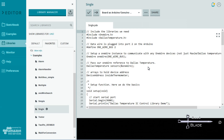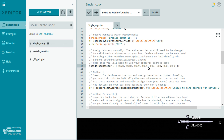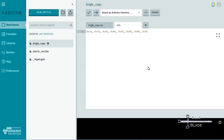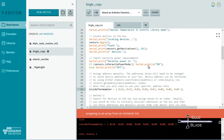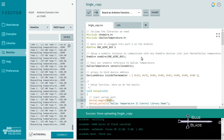Go back to Libraries and this time select a single sketch. Copy it into your project folder — we'll need to make some modifications to this. Paste the address we just found to the inside thermometer parameter. I also open up a new note tab and paste the address in there so I have easy access to it later. Copy the inside thermometer line and comment it out. Then above, we replace the undefined array declaration with this. Now change the value of the bus pin to 5 — that's the pin we're connected to. Finally, save and upload the sketch to your Arduino.